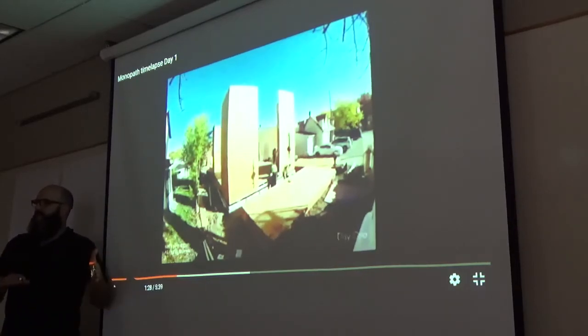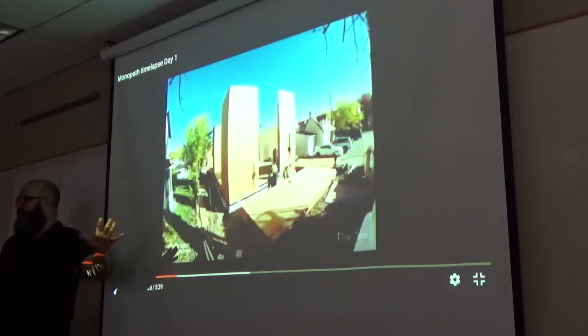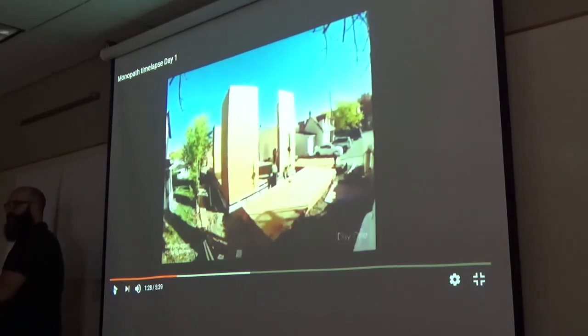But when you have 10 people on site, you rearrange the tasks that people would do. Like putting up glue: when you have 10 people, you have somebody other than the panel person do it. The panel person is not going to sit and lay out beads of glue because they need to be cutting panels and getting the next one out. But when you have 5 people, the pace is a little bit slower, and while that person is waiting for the panel to come back, they can lay out beads of glue. And of course, they need to time that, so they don't have that bead of glue setting down there and then skinning out, and something getting hung up, right?